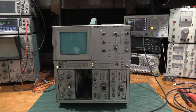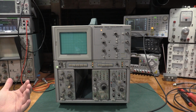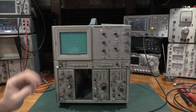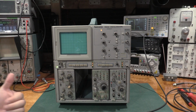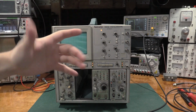From the testing in the previous video, which I will link in the description, we found out that the stability and things like that on this function generator is very good. That's really what you're paying for when you buy, quote, calibration equipment. It's a signal source, but it's a well-characterized, very accurate, very stable signal source. That's where the function generator is going to kind of struggle, and also with a little bit of speed. I'm expecting a little bit of difficulty when we have to do the high-frequency compensation where I need fast edges. The function generator might be a touch slow.